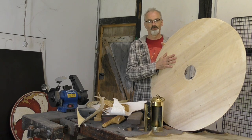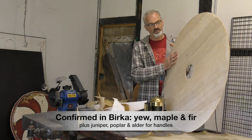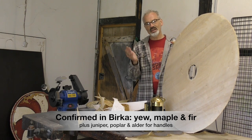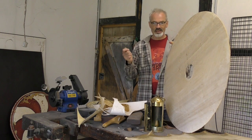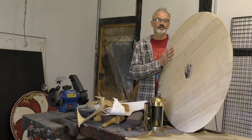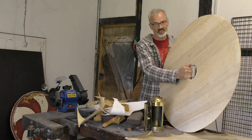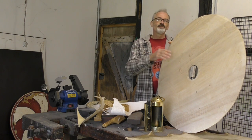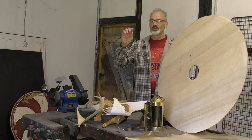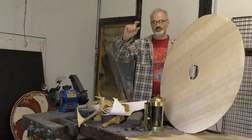Now this here is poplar wood. Most Viking shields appear to have been made of some kind of pine or fir. What is also important is that Viking shields were made from split planks — the tree trunk was split radially and these boards were then thinned down using the appropriate tools to produce the planks. The planks of shields like this are about seven millimeters on average, usually somewhat stronger in the middle section, with a distal taper in cross-section towards the edge.